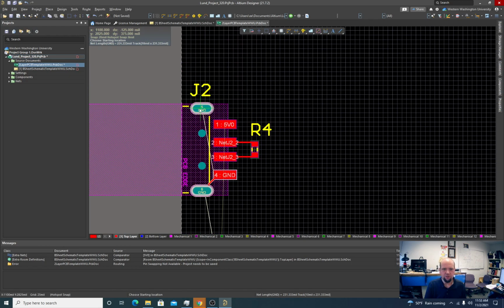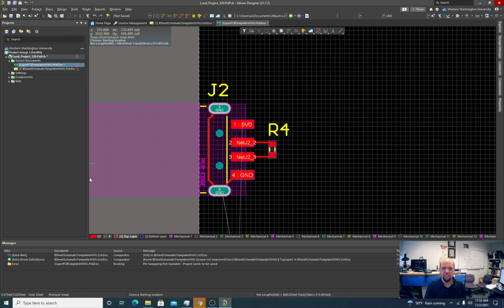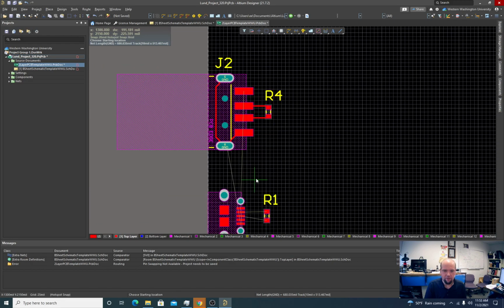There might be sometimes where you're doing a design where you don't want these signals connected to ground. And it doesn't really matter here that we ground both of these. There's a connection through the case of this, but there's a big metal bracket, so these are already grounded. But Altium's gonna throw a fit if we don't have these.